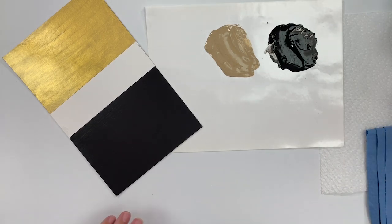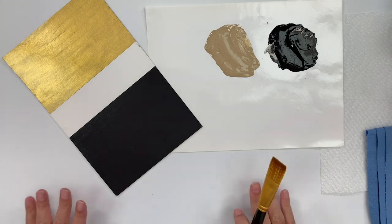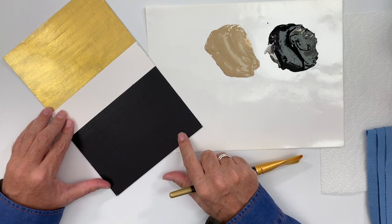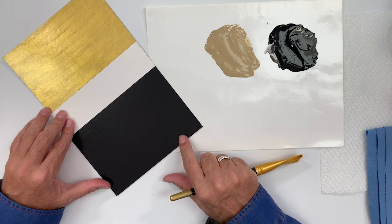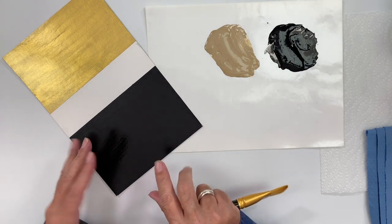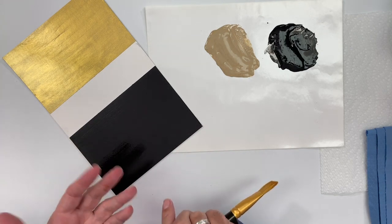Those three words are: leave it alone. If you don't get anything else out of this, you will learn to leave it alone. The color that you base coat is the color that shows through your crackle finish. The top coat goes on, separates, and allows your base coat to show through.